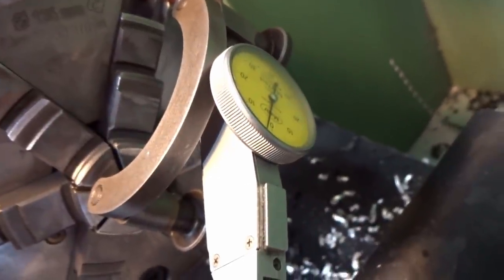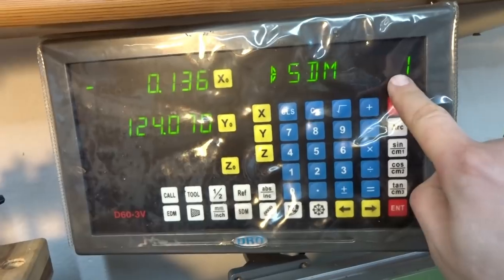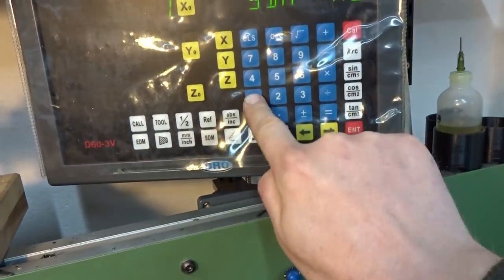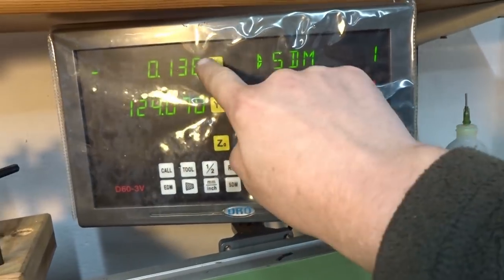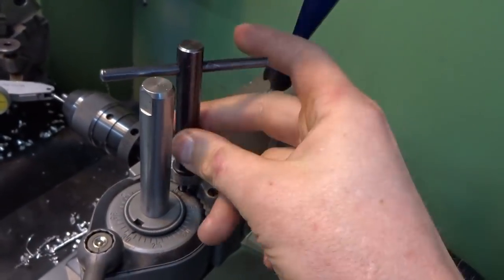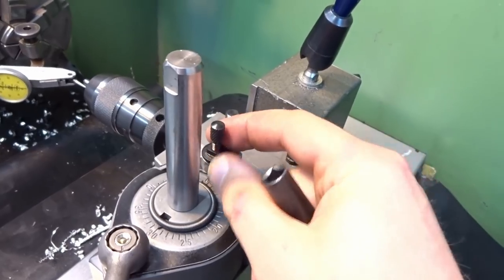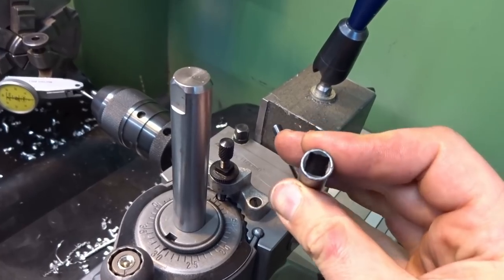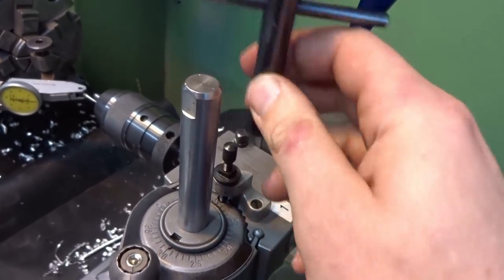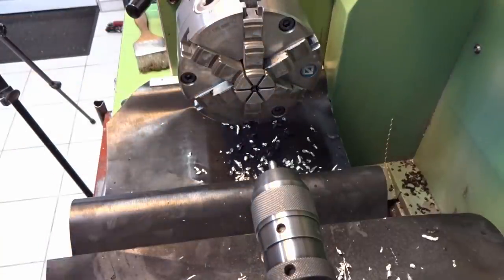Most drill chucks have some runout anyway. Here we are plus 20, and out here we are plus 22. Then we go to our DRO, look for the offset we want to use - I always use number one for the drill chuck - zero it out. Don't forget to lock the height adjuster; it's a good idea to use the wrench to tighten it down a little bit, even if some Multifix vendors tell you that it's a feature that their wrench is not drilled through. That's indicating in the drill chuck and this will serve for most purposes.